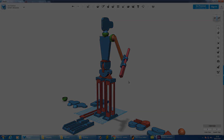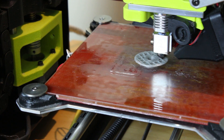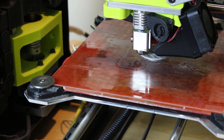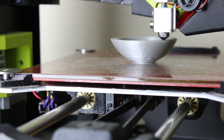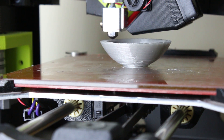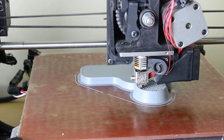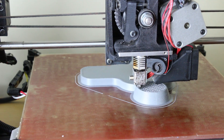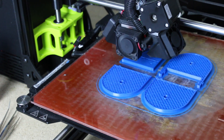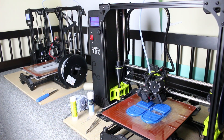Here's one of my NinjaFlex cups printing on the LulzBot Mini with a Flexistruder — it's done an extremely good job of that overhang so far, nothing has fallen underneath, so that five-millimeter brim seems a good orientation. That appears to be going extremely well, so let's just hope the size is right to grip the ball. Here's half of the head — half of the ball being printed — we need to do two halves and stick them together. And here are some other hip parts in blue ABS. We've got a combination of gray and blue for this, with a few printers working at the same time.